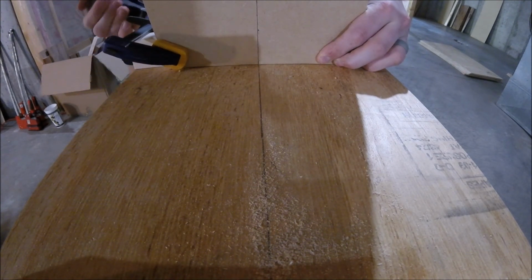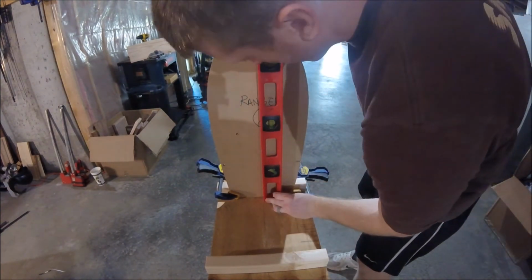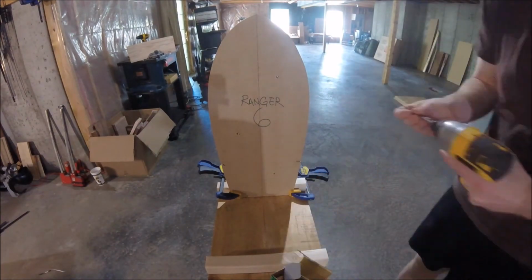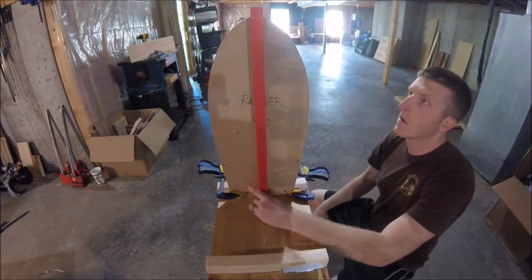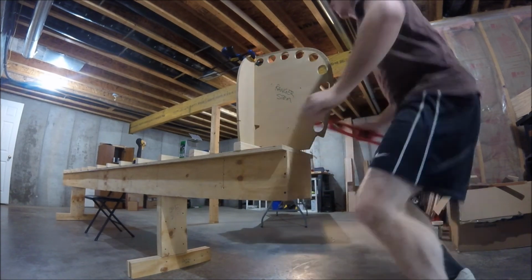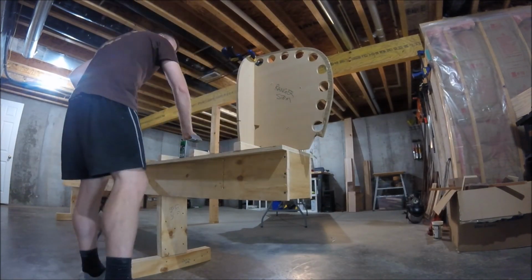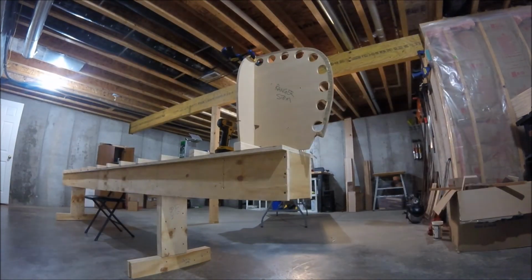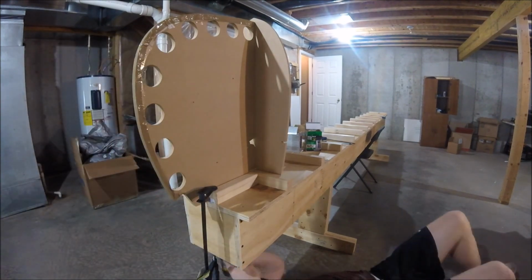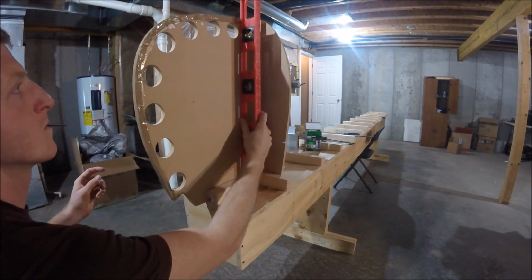Setting up the stem mold assemblies and the last full mold station are the most important steps. So grab a level and make sure it's completely plumb and true. Shim it as required because all the other molds are going to be based off of our 2 stem molds at each end. Use some clamps to hold them in place, and I even grabbed an extra scrap of my 1x1 material and used it to help support the stem mold. Once again, I just used some drywall screws and I attached them from the bottom. That way they really grabbed on to the strong back.